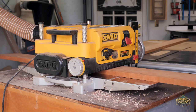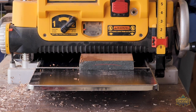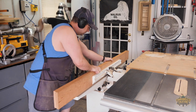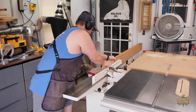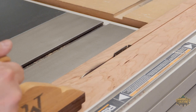For the short shelf that goes on top of the desk, I'm using four-quarter cherry. Since the boards I have are relatively flat, I started with planing first. In order to glue the boards together, I jointed the edge simultaneously to make a perfect seam. Using my table saw, I ripped each piece so that I could meet my final width dimension of nine inches.